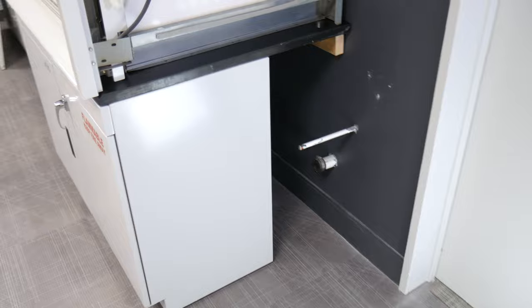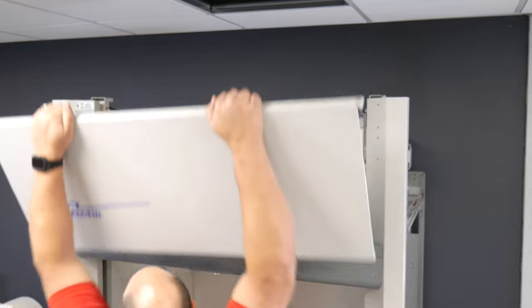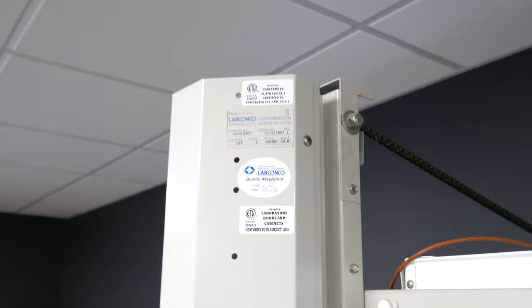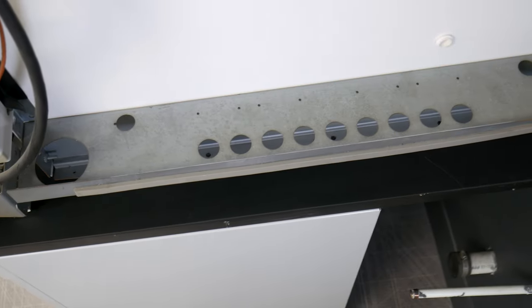Adequate space is provided behind the base cabinet for routing of utilities and service connections. You can direct the inlet tubing to the service fixtures through the openings on either side of the hood or work surface. Before making any electrical wiring connections to the hood, remove the front panel to locate the identification plate for electrical specifications. This is also where the electrical boxes are accessible. The electrical services can be routed from the top of the cabinet to the electrical boxes, or they can be routed from the utility space behind the base cabinet and directed through the service area up to the electrical boxes. An electrician should wire the hood according to local codes.